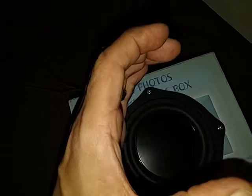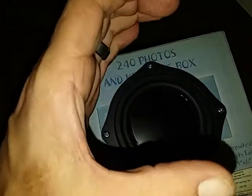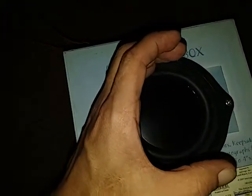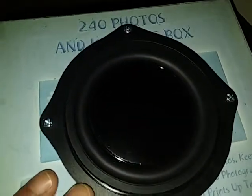I first make a tube and glue it all the way around the entire bass radiator. So now you've got a tube inside a box, and at the end of it you've got your bass radiator. It can't go all the way up or the speakers won't fit in. It goes up to about right here, and then I cover the rest of the inside of the box, so it's a box within a box.